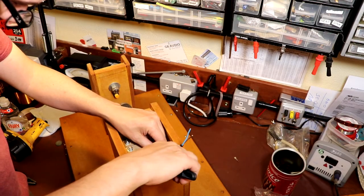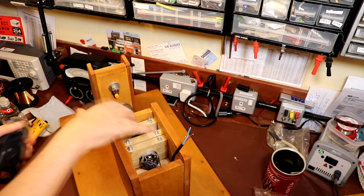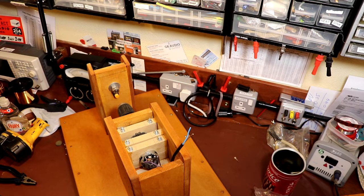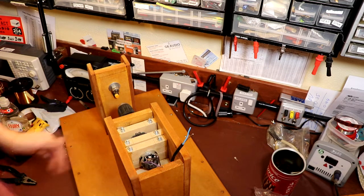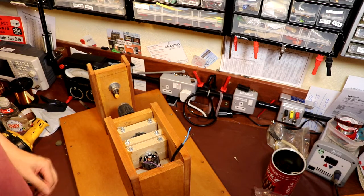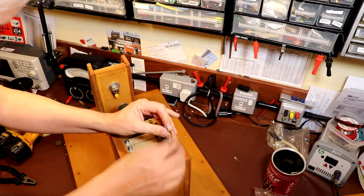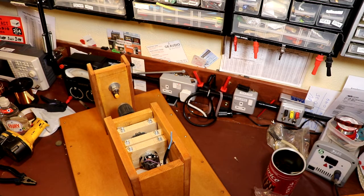I'm hoping it's going to be thick enough, this cable I've got. I'm hoping there won't be too much current going through this motor because there shouldn't be a huge amount of torque on it. It's not like I'm trying to drill through a brick wall, so I'm hoping it won't draw anywhere near its full load current. Well, fingers crossed, that's the idea, because unfortunately this is the thickest cable I've got to hand, and it's actually considerably smaller. We may have to end up changing that.